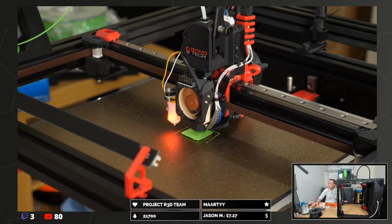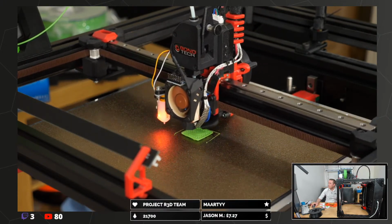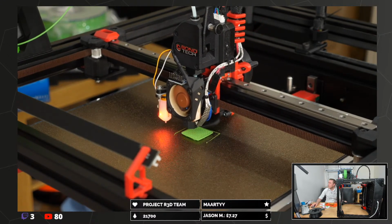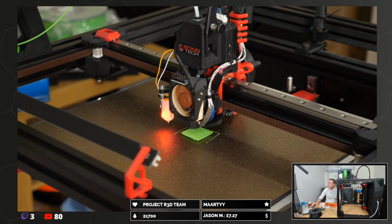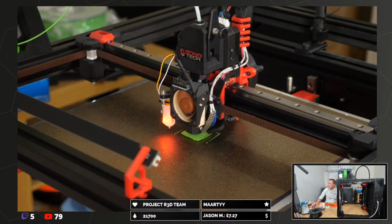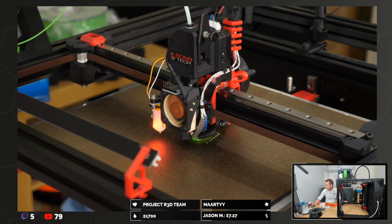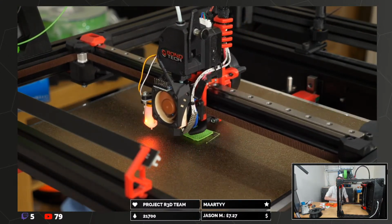So we could keep clicking that because it's right at the top. So instead of 150, we could put it at 100. That's still reasonably quick, isn't it? That's still quicker than I was doing. Yeah, it's pretty good blowy from the fan. It's making some good crispy prints.